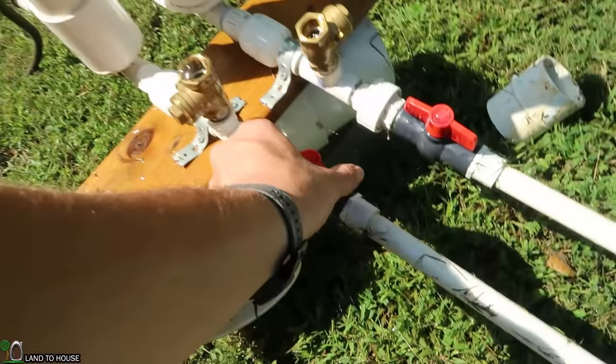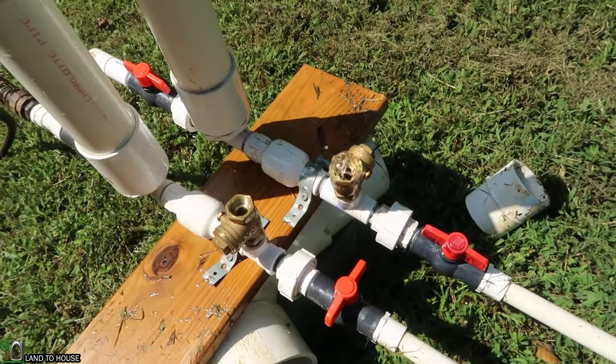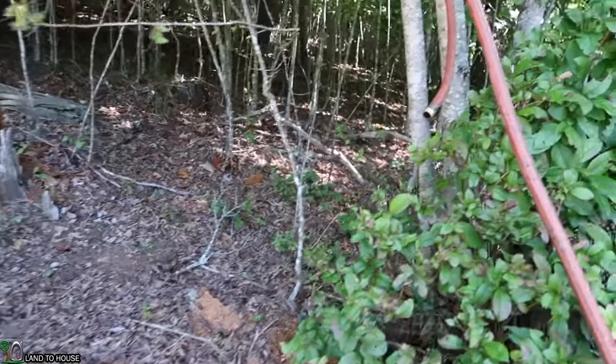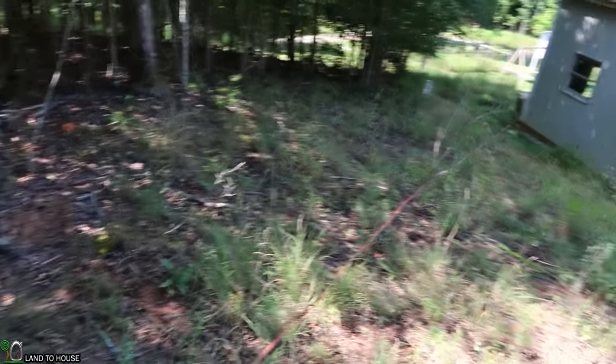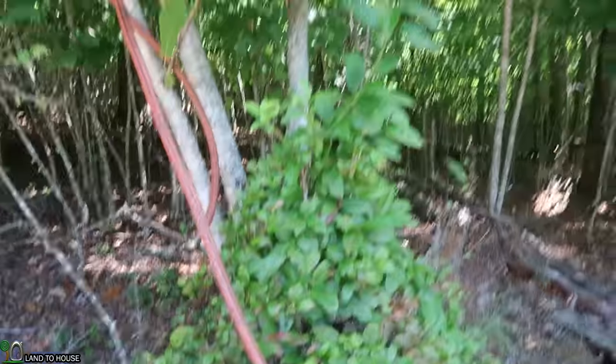To test that, let me turn off the original pump and leave on the second one to see if the water stops coming out up here — I think it's going to. Turning off the original pump, so we're just working with the secondary one. Just as I suspected, with that one less-efficient pump going, the water has stopped. So somewhere in that pipe it couldn't lift any higher, and that's where it stopped. Now we know why the output wasn't increased — the head pressure going to that pump plus the inefficiency of that 90° fitting prevented the water from getting up here, so it was unable to add height to the system.